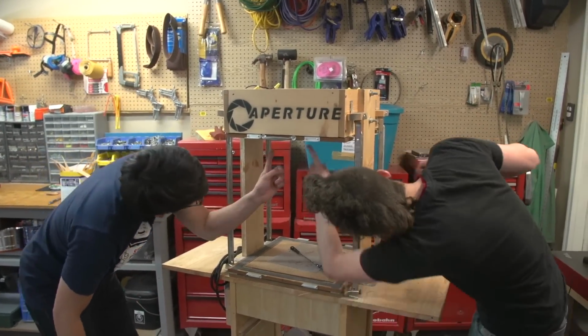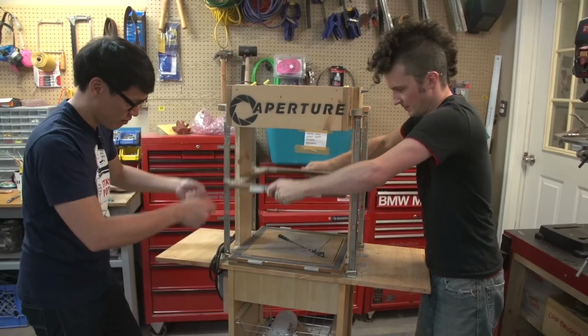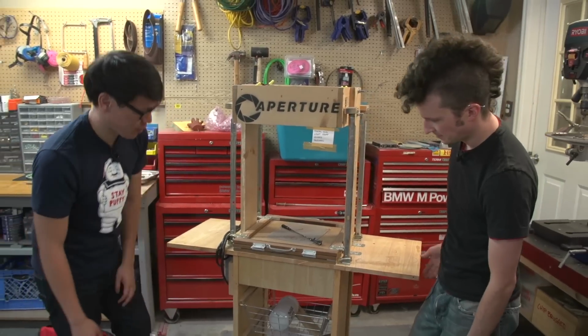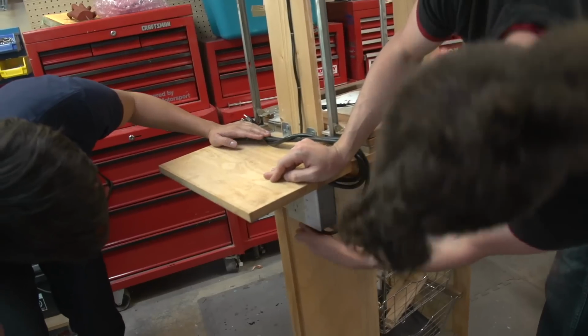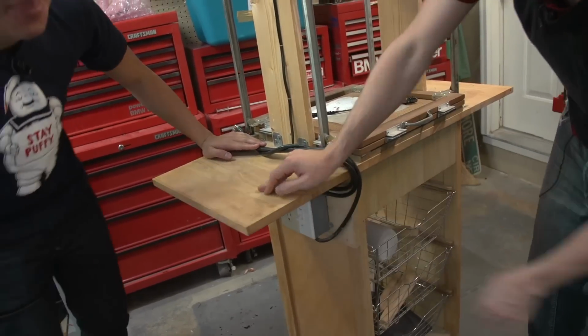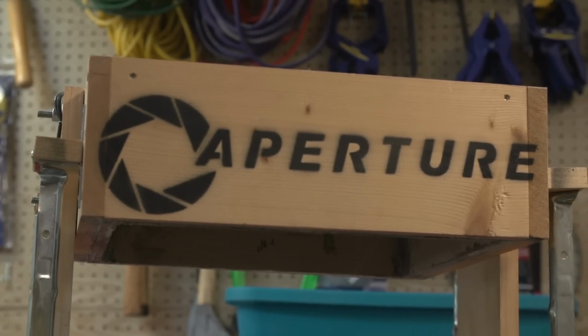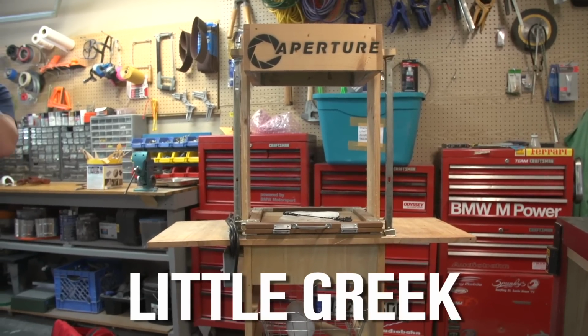And then those guys right there, heating elements out of a toaster oven. And then you just take this and plunk it down, turn on the shop vac, and away you go. You got trays and everything. Yeah, I used to hold up molds and stuff there. And I wired it up so that this is the power for the heater and, you know, my very professional switch covers. It's stuff I built out of scraps, and it worked incredibly well for a long time. Again, I still use this if I have small things I need to make.